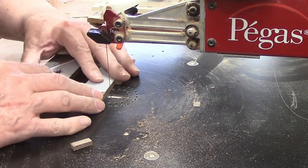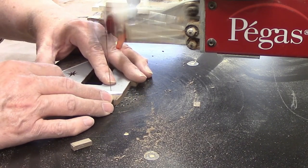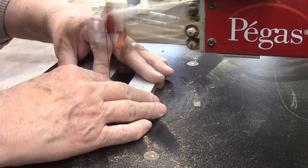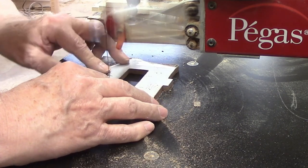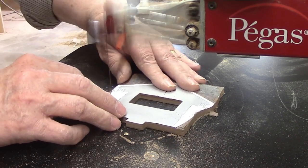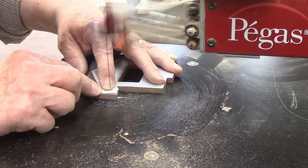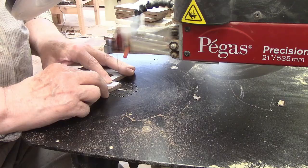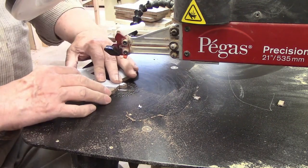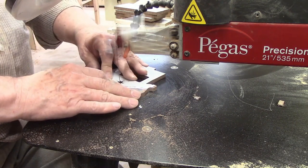This piece has some tiny cuts so I must decide how to make them best. I decided to pass two triangular cutouts on the stable side and return to them later — it will be much easier to cut these once the waste material on the outside has been removed. I did something similar when I came to the edges of the roof — I cut outside the lines so I could return later and make those detailed cuts from an edge. The roof itself consisted of vertical cuts at each end, a short horizontal cut on each side, and then the long straight lines for the top. These are all fast easy cuts.